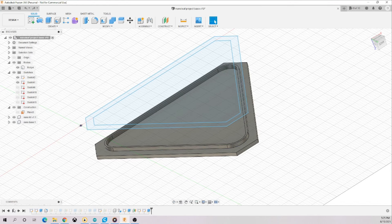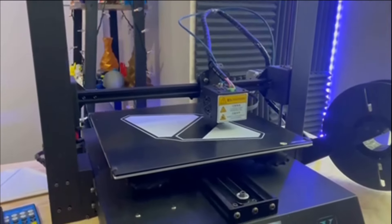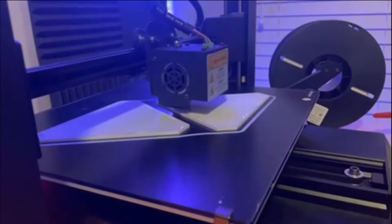The top cover is a diffuser that diffuses the light from the LEDs for a really nice effect. For 3D printing the bases, I suggest about 20–25% infill. For the top diffuser lids, I printed them with 5% infill and a grid pattern, which gave it an 8-bit video game nostalgic aesthetic that I really enjoy. I recommend 5–10% infill so the LED light shines through well. For this project we're printing 10 triangular panels — 10 bases and 10 diffuser lids. STL files for both will be linked in the description.